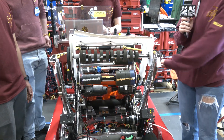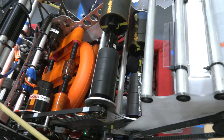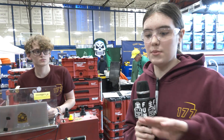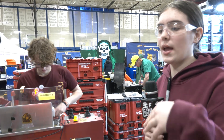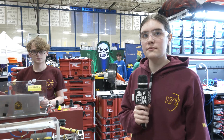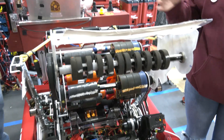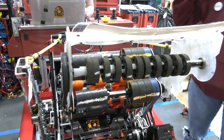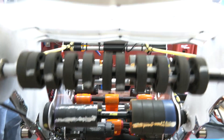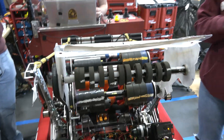Our intake automatically stops once the note reaches the perfect position in the robot, then we have spin-up and the note goes through. This part doesn't curve it down — it helps propel it and stops it from going out once it's in the amp, so it works best with the amp there. When analyzing the Crescendo game, we had a priorities list: being able to drive, shoot in the speaker, climb — all these higher priority items we wanted to make better. The trap mechanism got cut so we could focus on those.